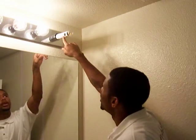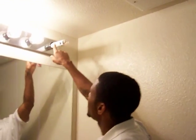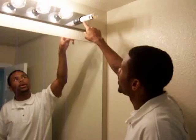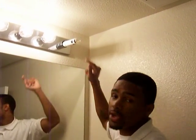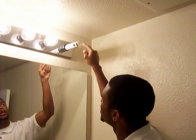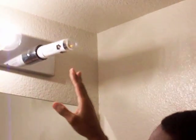I'll distribute the power on. As you can see, we have the first indicator: if the lamp blinks, it indicates that the lamp is actually okay. If the lamp does not blink, then you'll want to check your starter. But for this particular situation, the starter is perfectly fine.